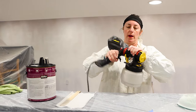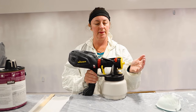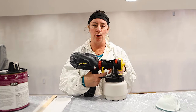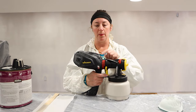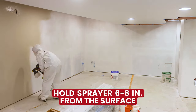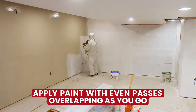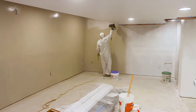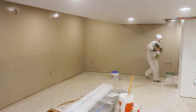Now we put the nozzle back on and turn it on. On this model, paint doesn't flow until you pull the trigger. Some models turn the blower on and release paint with the trigger, but this one is a two-step: power on, then pull the trigger. Hold the sprayer six to eight inches away from the surface and apply the paint with even passes, overlapping as you go. It is easy, intuitive, and fun. Be sure to subscribe and tell me about your Wagner paint sprayer experience in the comments.